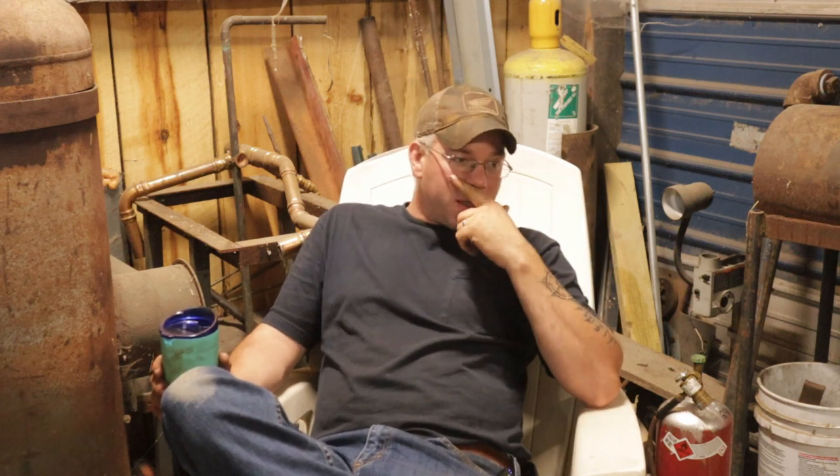It's really good stuff. My favorite steel to use is 1080 for the things I do, my draw knives and chisels and stuff like that. It performs phenomenally, holds an edge really well, is easy to work, and is very forgiving in the heat treat. I don't do a lot with 1095, which is often your files, because I don't have a suitable oven for heat treating it properly. Sooner or later we will get a heat treat oven, whether I make one myself or we buy one, but that's definitely on the list.